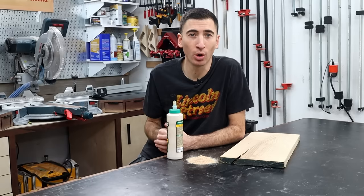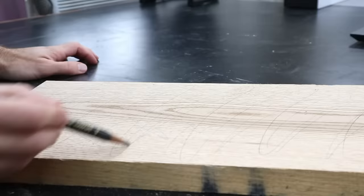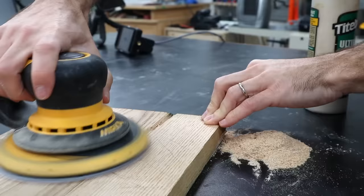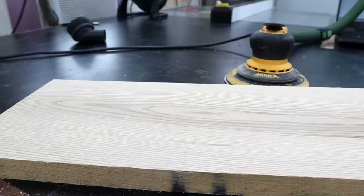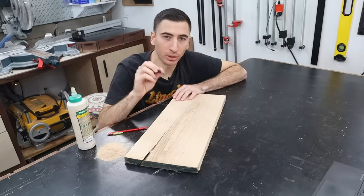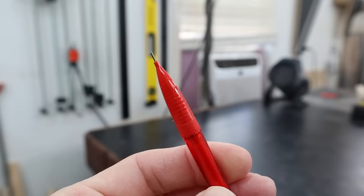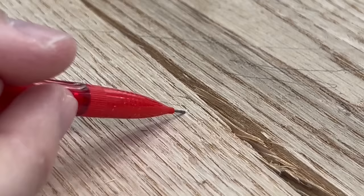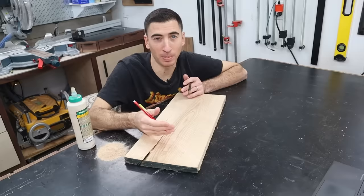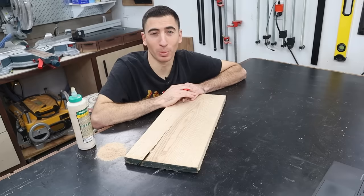Let's go for a bonus sanding tip. To help keep track of your sanding progress, scribble all over your board. The idea is that once you've sanded that area enough, the lines will disappear and you can move on. Once all the lines are done, you move up to your next grit. It sure does work. However, make sure you're using a nice thick pencil, especially on something with an open grain like oak. Tiny mechanical pencils can dip down into the grain and leave marks below the surface, and the only way to get those out is by sanding a divot into the spot, which totally defeats the premise of this trick. So overall, this is 100% fact.